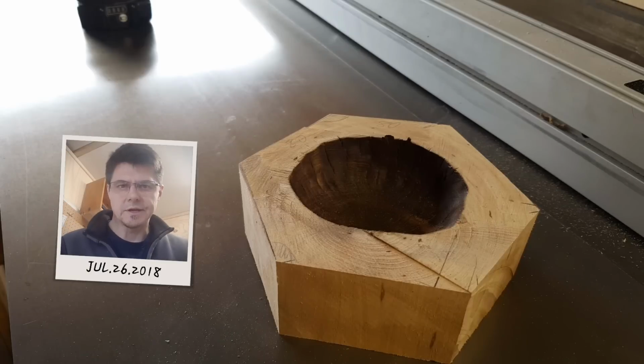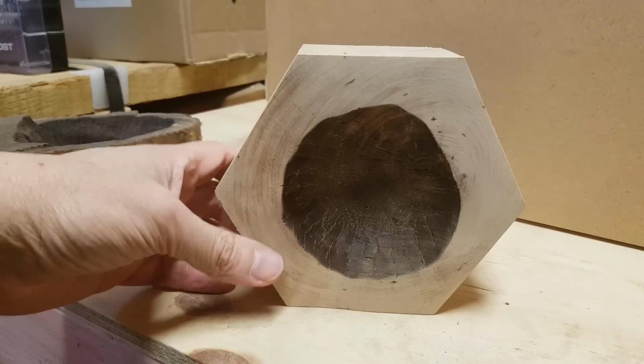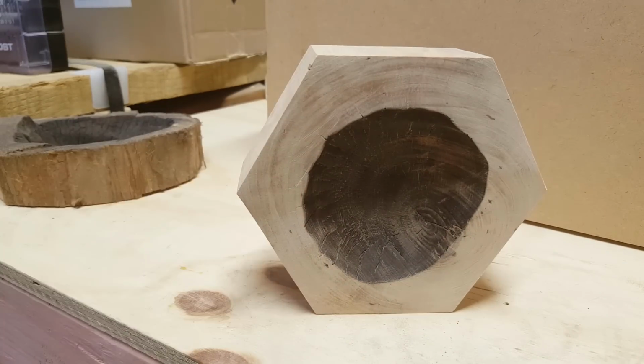So I've trimmed it down into a hexagon and I have all the angles correct at 120 degrees. But the sides are slightly different lengths in some cases. So now that I have opposite faces parallel to each other, I can just run it through the table saw to fine tune the length of the sides that are a little bit out. Kind of like this. I know it's not perfect, but...